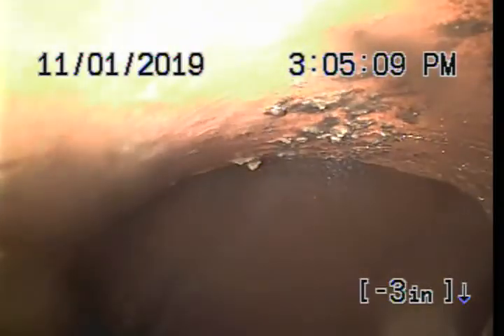We're looking at the Spokane City sewer right here. You'll always be able to tell where the bottom of the pipe is by where the little bits of water are, by where my camera light is. That water that we see running is from a toilet flush, just residual coming down the pipe. We're pulling into what looks like a six-inch clay tile pipe.